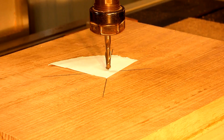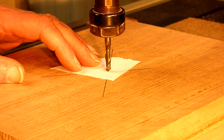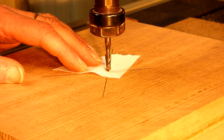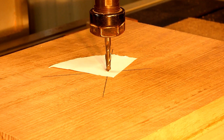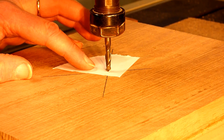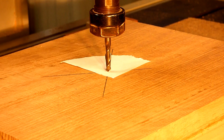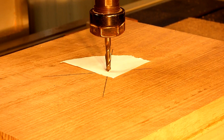Going to the jog — you can be very precise with this. So that's within two thousandths; we'll take it within one thousandth of an inch now. That's it, just touching it. One more and it's just grabbed it — so that is absolutely perfect on the material there.